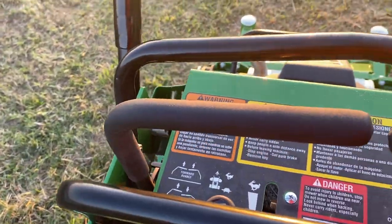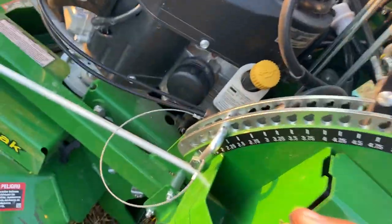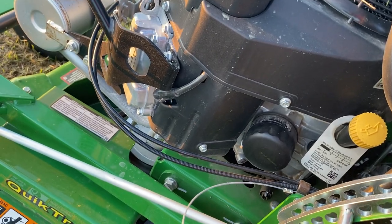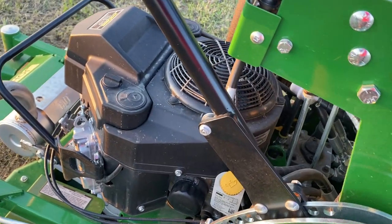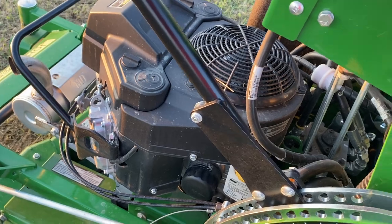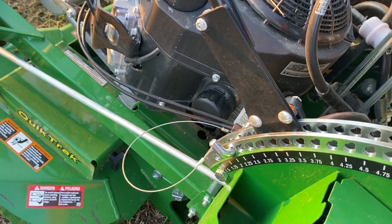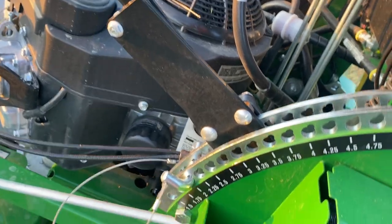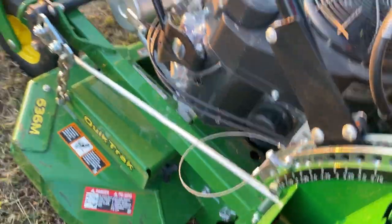Controls are simple. There's an emergency brake here. A lot of quick track mower reviews I've seen had the deck height adjustment on the controls area, but I'm glad mine doesn't — your deck adjustment is here separately. It goes from an inch and a half to five inches. You've got a pin system like my zero turn has, but what I like better about this is it can still lock in anywhere — you can pull it up and drop back to where the pin was without necessarily moving the pin every time.